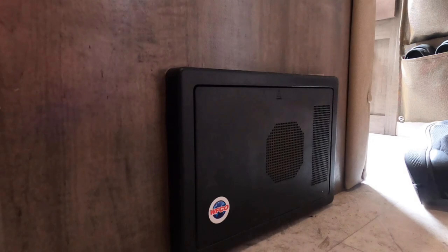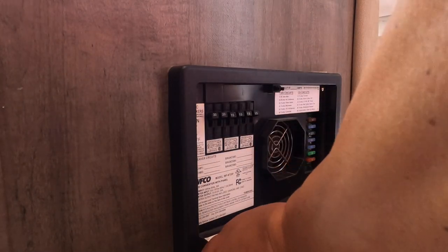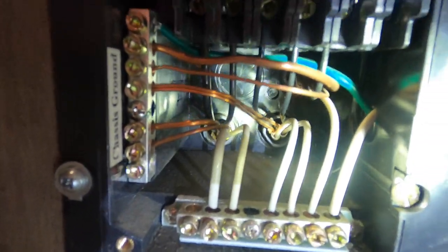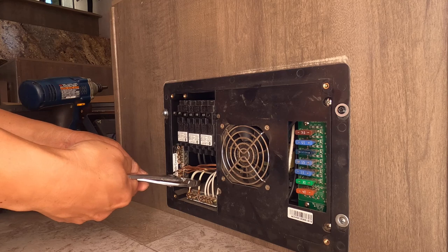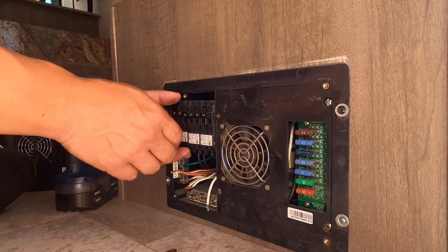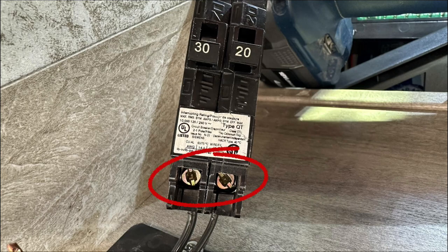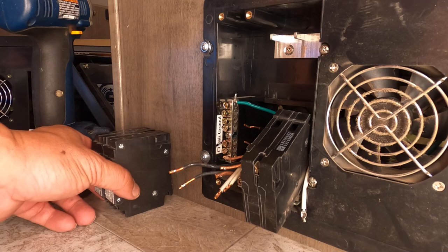Now you're ready to disconnect the old power center. First we will remove all of the 110-volt wires connected to the breakers — double checking that all power to the trailer has been turned off and disconnected. Remove the door and then the cover of the old power center, exposing all the wires leading to the breakers. To make space to remove the breakers, release all of the ground wires and the white neutral wires from their connection strips. This creates real estate inside the power center to get those breakers disconnected. Be careful because we're going to be reusing each of those breakers in the new power center. Remove each breaker one by one by firmly pushing down on the upper corner of the breaker and pulling it out. When you turn the breaker over, you'll see the connection terminals securing each wire — loosen these screws and the wire will release from the breaker. Do this same process for each of the breakers.